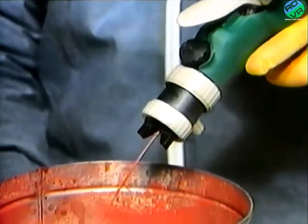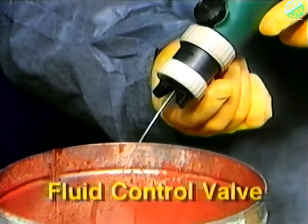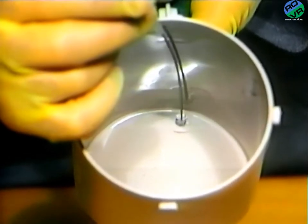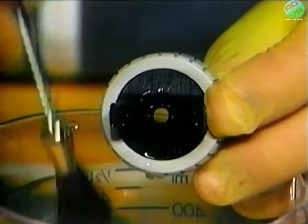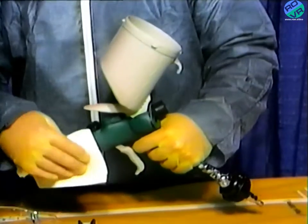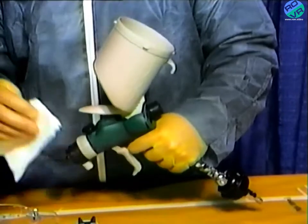Now it's time to flush the fluid passages with clean solvent. Start by pouring a little bit of clean solvent into the cup. Aiming the OMX into a waste paint container, pull the trigger while rotating the fluid control valve back and forth. Use the tube brush to clean down into the drain hole and Teflon fluid tube — the drain hole must be kept clean or the bushing won't seal tight and it will be tough to remove. It will clean better if you twirl the brush in the drain hole. Now clean the air cap: remove the cap and brush it and the fluid tip with clean solvent using the larger cleaning brush. Do not use a hard instrument to clean out the air cap and fluid tip holes — they can be damaged and will ruin your spray pattern. A toothpick or some other soft instrument works best. Finally, dampen a cloth with solvent and use it to wipe the outside of the gun, including the outside of the fluid tip. Wipe the gun dry and blow out the paint and air passages with about 30 psi air pressure.